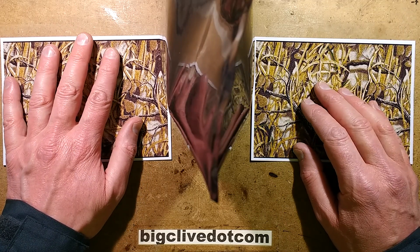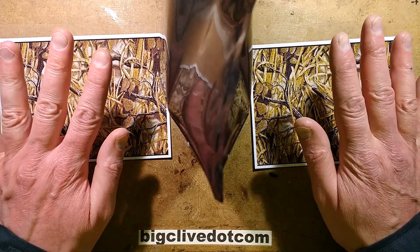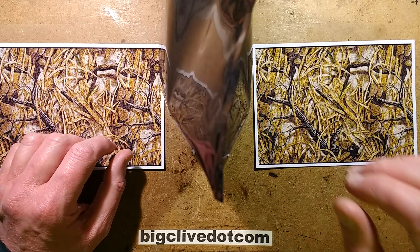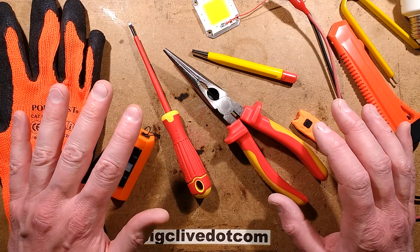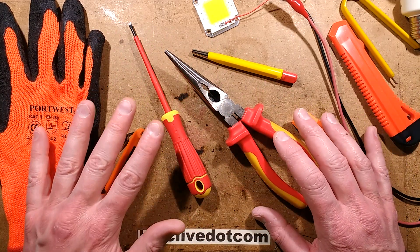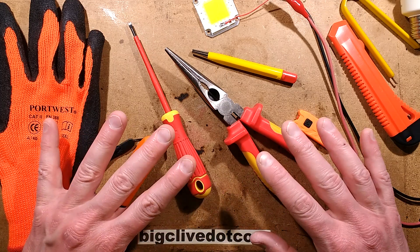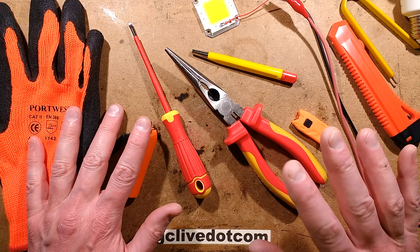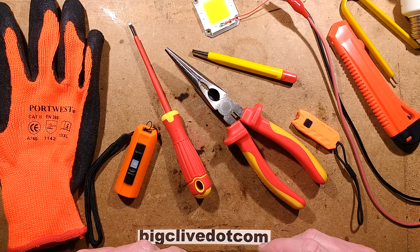I'm going to get rid of the barrier now and swap this second LED up here so we've got both as high colour rendering index, and then we'll discuss what colour rendering index actually is. With both CRI LEDs now installed, the first thing I noticed was how the reds and yellows are absolutely popping — colours that were pale before are now really bright and vivid. It's as if part of the spectrum has just been filled in, which ties in with their specialist use of red phosphors.